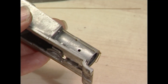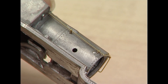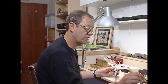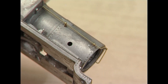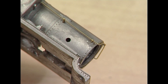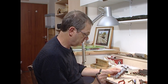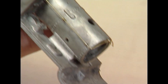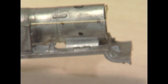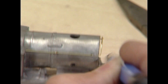Now we wind the iron up a little bit. I'm going to secure the handrail to the handrail pillar. This time I'm using 145 solder — I was using low melt to attach the brass to the white metal, and I'm now attaching brass to brass. Be careful though, because I've got a very hot iron in the vicinity of the white metal. So just touch the handrail pillar — don't touch the white metal. Let's clean that up; there's a fair bit of flux.